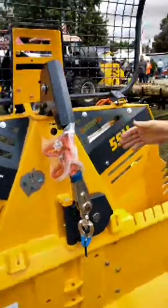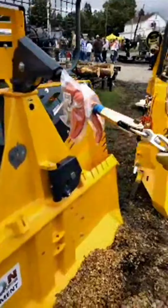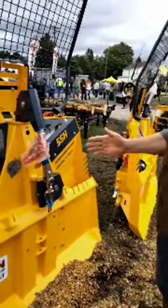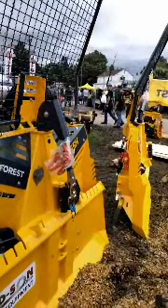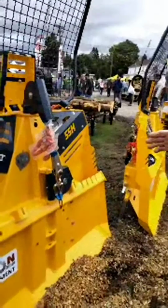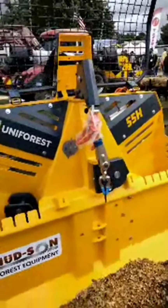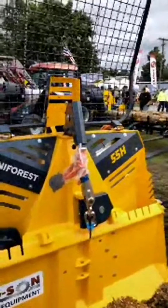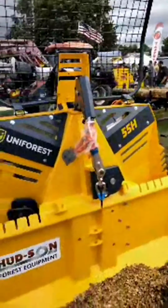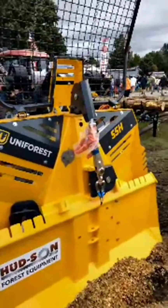Okay. You put it on your tractor. You want to go out with your cable, you just hit the release button on a clicker, start running with your cable, make your hitch. The big advantage of these is you can walk your hitch to the tractor. So when you got the log on and you're walking up with it, you're definitely out of the way of the skidding range. But if you see a snag coming up, you can avoid that snag by stopping the winch, loosen the cable, maybe put a snatch block on to pull the tree over a little bit. And it saves walking from the tree back to the tractor every time you make a hitch, and then you snag something, then you got to walk back down to the tractor again. So yes, they are very, very handy.